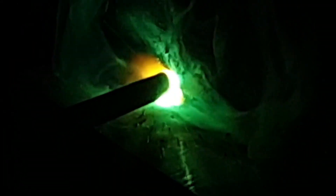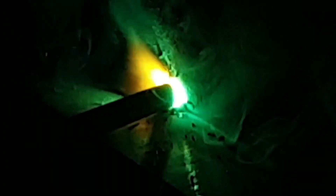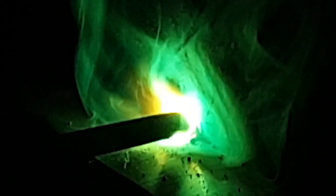For this demonstration we're going to be using 7018 low hydrogen rods and we're going to be using the multi-run technique doing three runs. Whenever I'm teaching someone to start welding, we always start off with this technique — the T-fillet and multi-running. This helps you multiple ways: blending in your runs, making them look consistent, and keeping a nice tight arc.